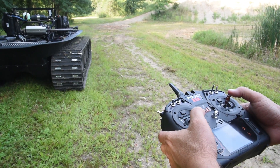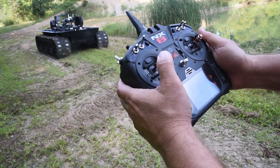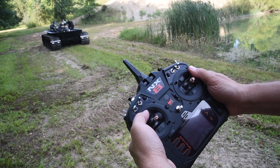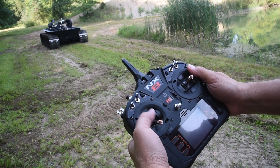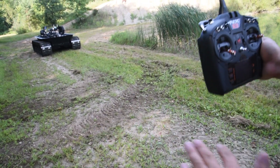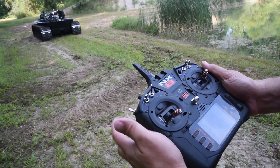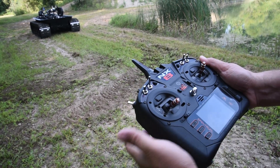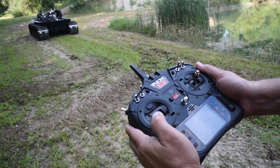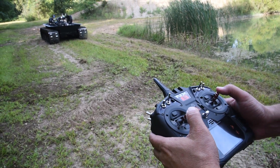Pull the stick back and it stops. I am going to demonstrate killing it — so it is going, if you do not like what you see, done. Make sure that you always bring it back to stop. Put it back in neutral. You can see what happened or if somebody was in the way, you can clear the area. Turn the power back on, hit the start button, rev it back up, go back to forward, and continue driving.